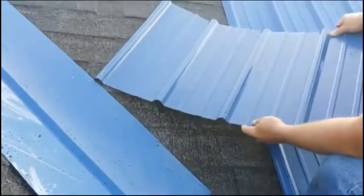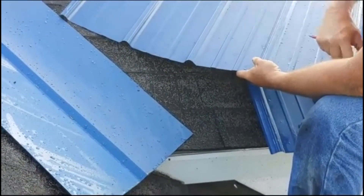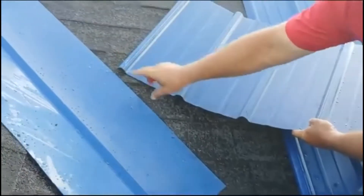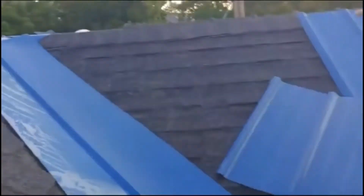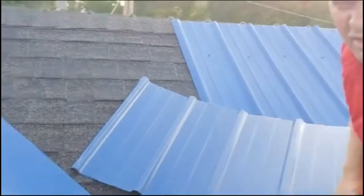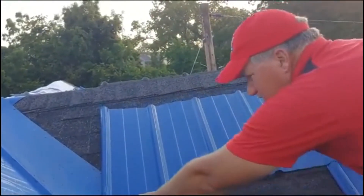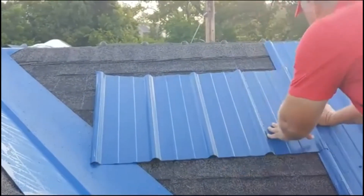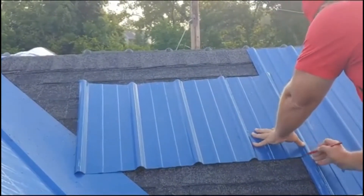Now, I usually have a small cutoff piece so I can get the factory square edge. What we're going to do is find out where this corner — the outside corner — hits on that line. And we're going to slide it up with this sitting solid on that rib to find a square. It's just another reason why it's important to be as square as possible. See how I'm coming down to this four-inch mark right here? Right there, sitting square on that. And then I'm going to mark right there.